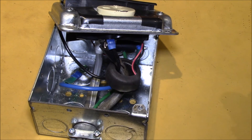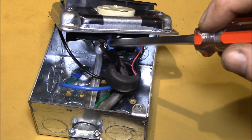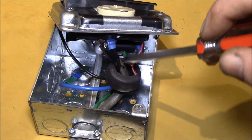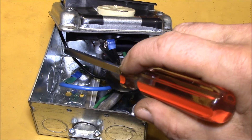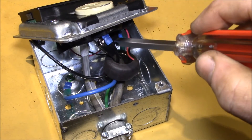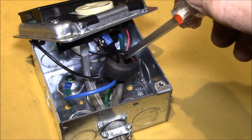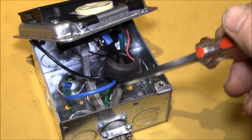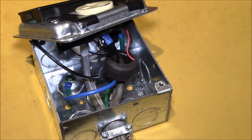I've made one small change to my 240 volt split phase kilowatt meter. I've taken the power wire that feeds the panel meter and run that black wire from the incoming power connection down through the current transformer and over to the meter. What that does is it takes the current feeding the meter and runs it backwards through the current transformer, essentially performing a subtraction - you have current coming in on the main power wire minus the small current going to power the meter.